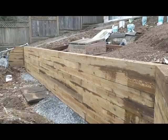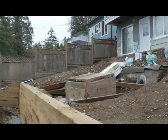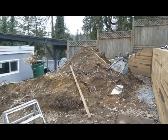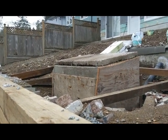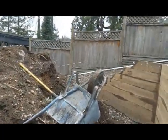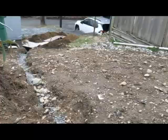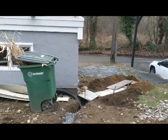The wall is completed — took a little bit of work, but it's done. We started with the septic tank, checked the septic tank on the end, pretty much we turned upside down the backyard to find all the distribution boxes — we have five in here, so they are all nice and accessible now. That one in there we just had to raise it, lift it up a bit, that we have access to it once we pave this area. I'm happy with the retaining wall — gravel from the bottom up to the retaining wall, behind the retaining wall. We have the big pipe behind the wall that way to remove the moisture, and at the same time there will be some air circulating between the pipe and the gravel, so it will last longer. The pipe is still there going down, just in the process of digging to connect the main pipe for drainage.